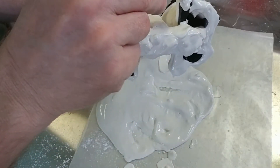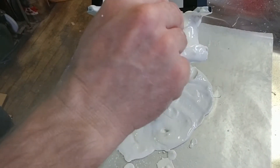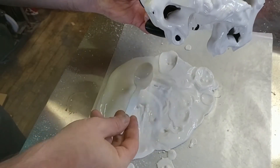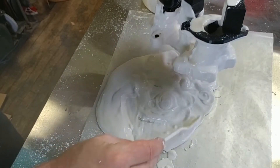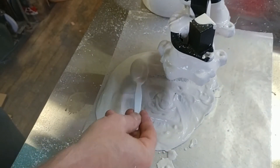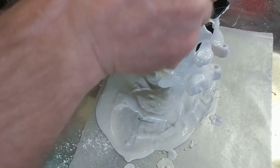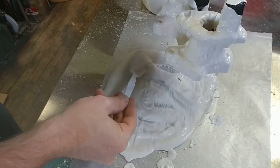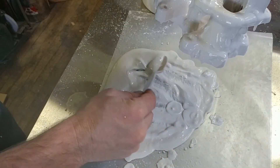Since I'm going to be probably pouring this all in — okay, let me put it this way. I'm going to build a mold out of some cardboard or something and then pour a whole bunch more Plaster of Paris on top of this whole thing. That will probably handle all of the issues I may face with not having all of the holes filled. By the way, I have some casting holes in this, and it's not actually a good idea. You should probably mill all your holes afterwards, because things just change shape enough in the process of cooling down because of the thermal constriction of the aluminum that you end up with sometimes having hot tears in your mold, because the mold fractures around a piece of Plaster of Paris or whatever refractory you're using.